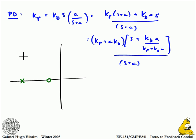And then I can get all kinds of fancy and complicated. It turns out there are numerical instabilities that you run into from round-off error, so there are ways of implementing it that work. In theory, it doesn't matter which way you implement it; they all work equally well. In practice, you discover that often whether you have 0.999999 or 0.9999999 as the coefficient will make a huge difference in the stability of the thing. Your round-off errors start cascading and giving you problems, and so you try to implement double precision in a microcontroller, and you discover that this doesn't work so well. It does work pretty well, even in a microcontroller, if you know what you're doing and you're careful.